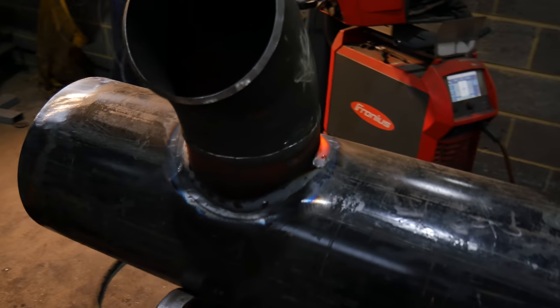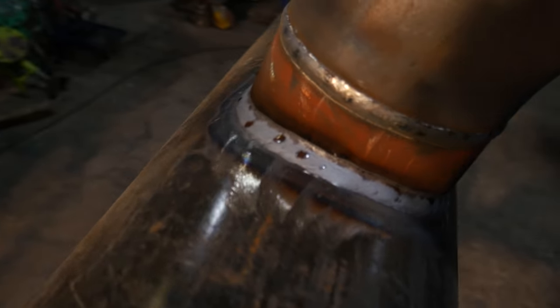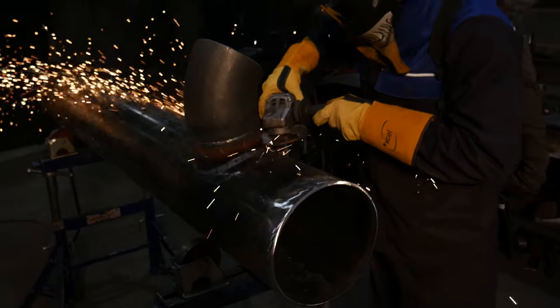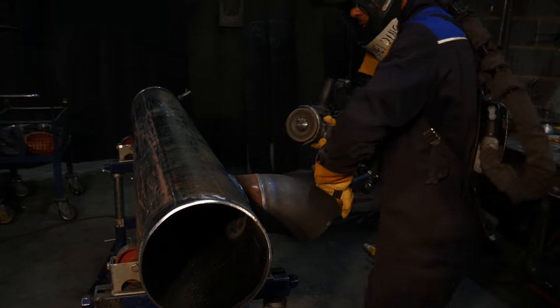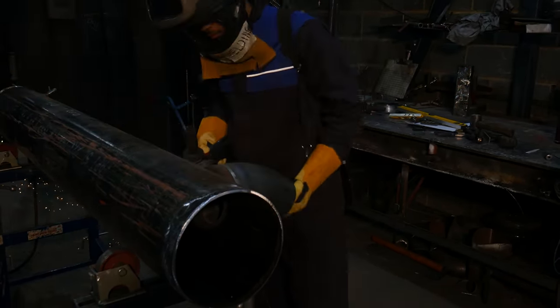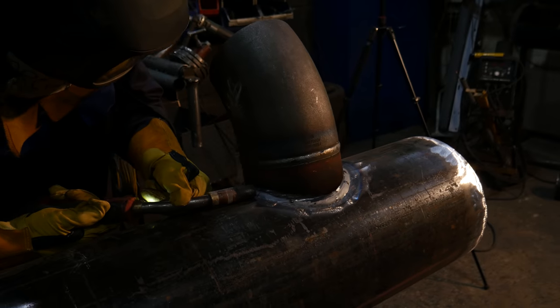Now depending on how I start off, I may turn down the power for my second run. What I'm about to do is grind the top of the weld just in case there's any holes or anything between the two layers. Lovely — there weren't any holes, but it also gets rid of the silica so your welds go in a lot more nicely. Now I'm going to start further back so I can go over my start stops nicely. I may turn down the power a little bit now and see how it goes. I've turned down the power and I'm going to move a lot faster as well.